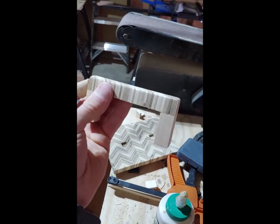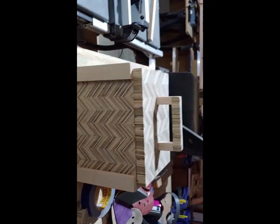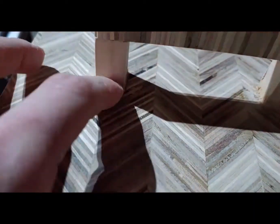After it was cut to size I went ahead and sanded the whole piece so it looks very nice and uniform, then glued it into the top. I used epoxy — probably not necessary — and to fill the gaps I used sawdust mixed with glue to make it look flush.